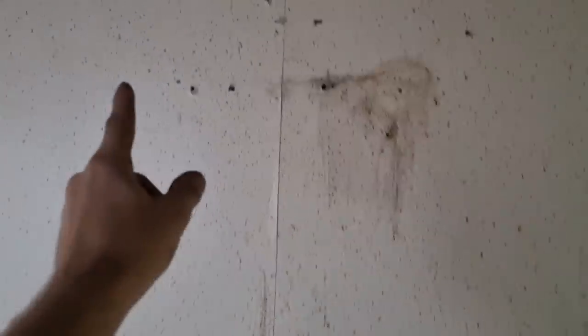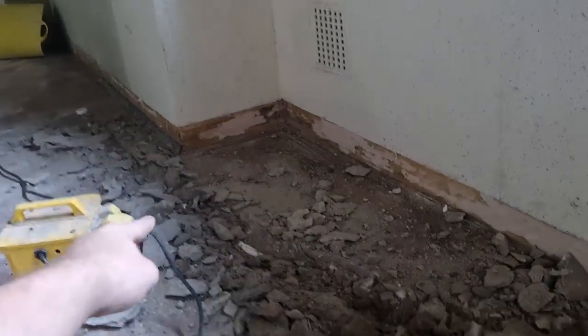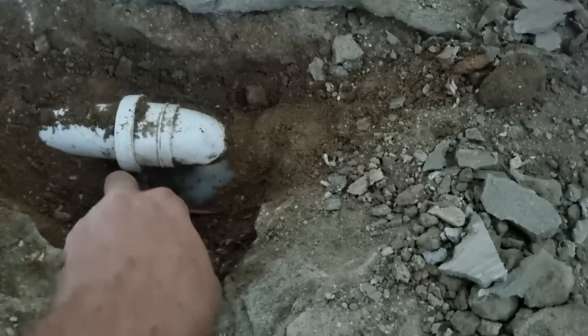The basin waste ways will just run in the stud wall and then into the main four inch — I think that'll be better. We won't know until we get the floor chopped up. First job is always get stripped out, second job is always get your drains set up. We've got to demolish this whole wall as well so I'll give the lads a hand. It's all solid — not structural — but we'll get it all out and form the new openings. The floor's really wet down here as well, so I'm guessing whatever they've done here was a bodge — look at the amount of silicone and how wet the floor is.